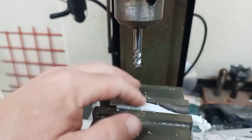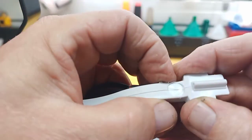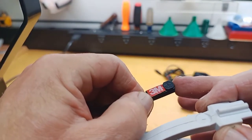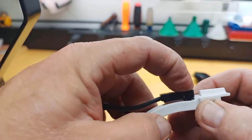Okay, clean that up a little bit and we should be able to put the sensor in place and zip-tie it in place. A couple quick notes: you do not want to cut all the way through there. This does not need to see the primer — it will sense it. It is an inductive proximity sensor; it senses metal. So what we'll do is insert this, double-sided tape it, and then zip-tie it.